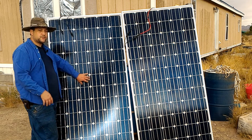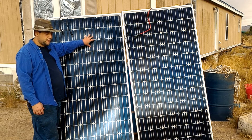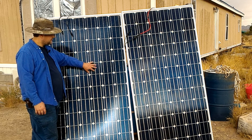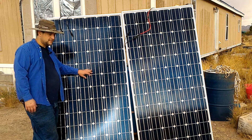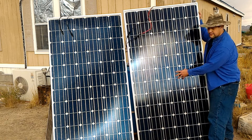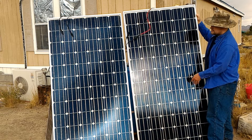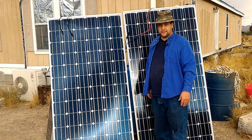It doesn't have the strength it had anymore. So we need to put that security film on it and reinforce it on the back to provide support. Because right now, if we got a really good snow load, this would come apart. Now let's take a look at this other one — when I move it, it doesn't move the same way. When I push on it, it doesn't want to give. The glass on these panels is really important for their structural integrity.